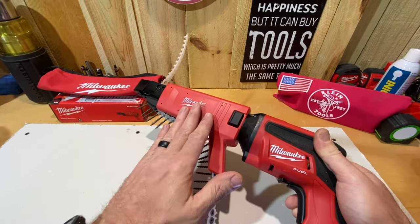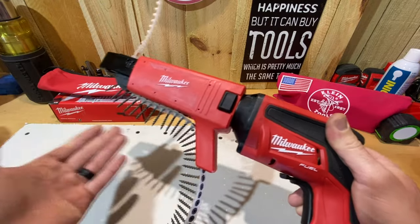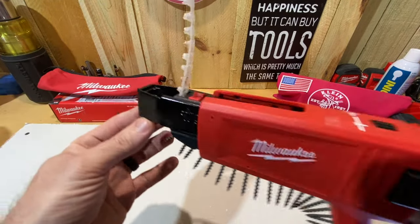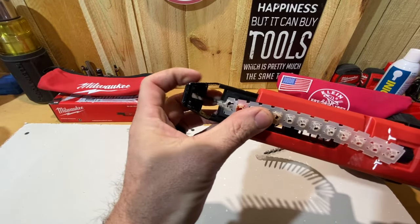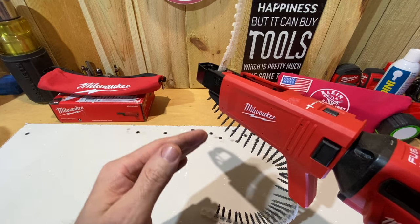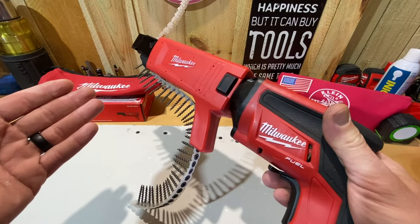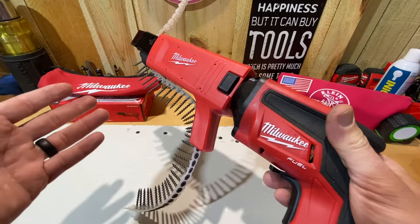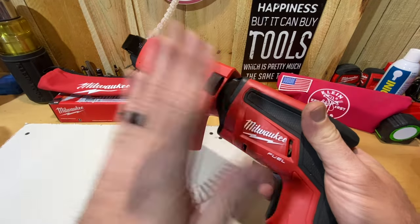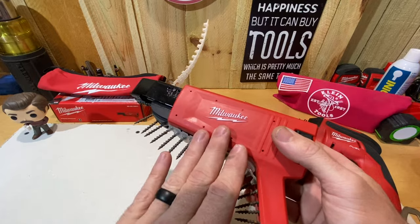An advantage is screwing out in the open field, but one disadvantage — shared with this drywall gun even with a regular head — is getting into corners. It's hard to get into corners with one of these, even though this one has a tapered head to help a bit. When you've got a stud in the corner and the first piece of drywall is already covering part of it and you have to go in at a steep angle, it's very hard. I'll often have my Surge impact on my belt with a Phillips bit to handle corners, then use this just for the field.